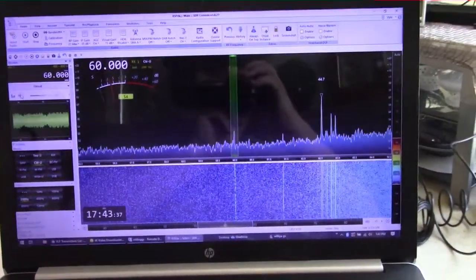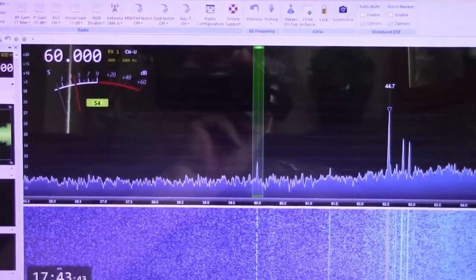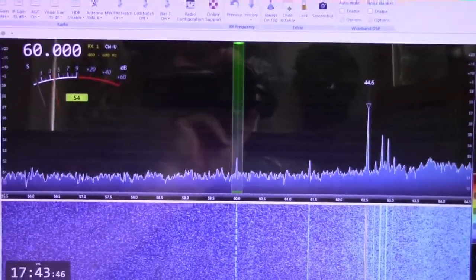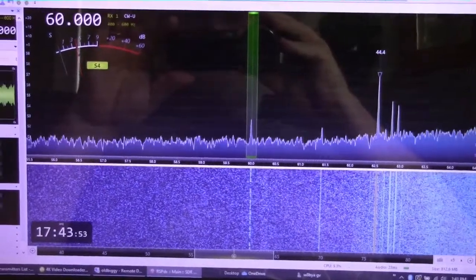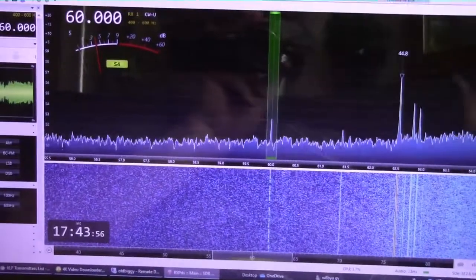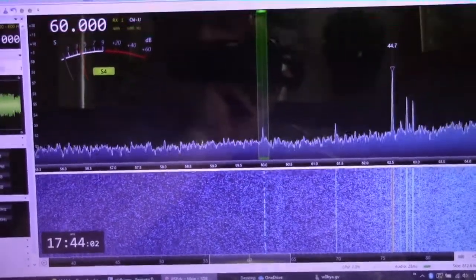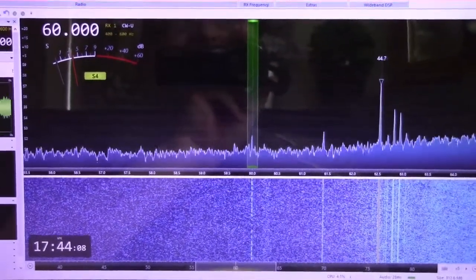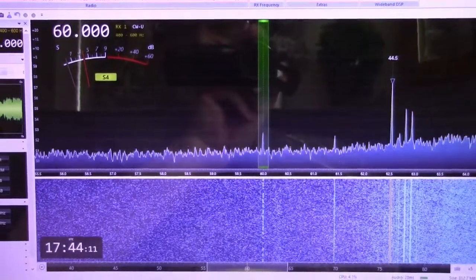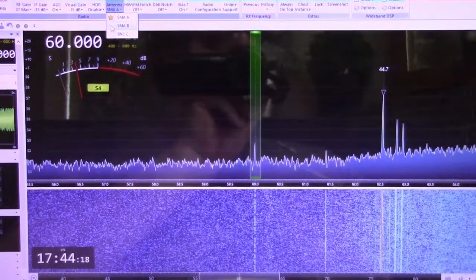Well, we're basically pointing to the west, and you can see there's WWVB coming in, so even in broad daylight, the W8BYA modified YouLoop does pretty good. I've actually heard it much louder during the daytime. Today the conditions seem to be quite poor. It's generally at least 10 decibels louder than what it is right now. And just as a comparison, we'll switch over to the MLA-30 Plus.